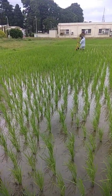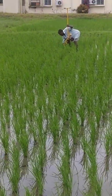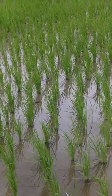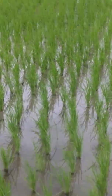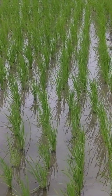Only three to four hours are necessary per biga — that is, one-third of an acre — to operate the tool. In between, sometimes we have to remove the mud. What is necessary is that there must be at least one inch of water on the rice field so that the machine moves properly and mud does not adhere to the rotor cones.